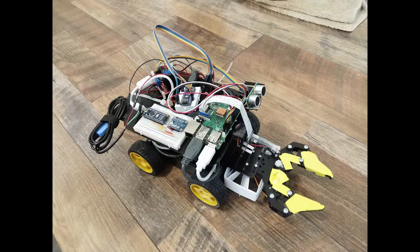The robot is controlled by a Raspberry Pi 3B+. The position of the robot is monitored using Hall-effect sensors as encoders, and the heading is monitored using a Bosch BNO055 IMU. The encoders and IMU are read using two Arduino Nanos, and the data is transmitted to the robot using serial communication. An ultrasonic sensor is mounted on the front to detect walls, and a Raspberry Pi camera module is attached for computer vision purposes.